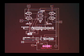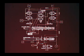The pressure regulator is located in the steering return to reservoir circuit and causes a back pressure condition in that circuit. The pressure level maintained by the pressure regulator is used to hydraulically actuate the reverse lockout spool. When the pressure in the reverse lockout circuit reaches the regulator setting, the regulator opens to pass all excess oil volume into the clutch lubrication circuit.